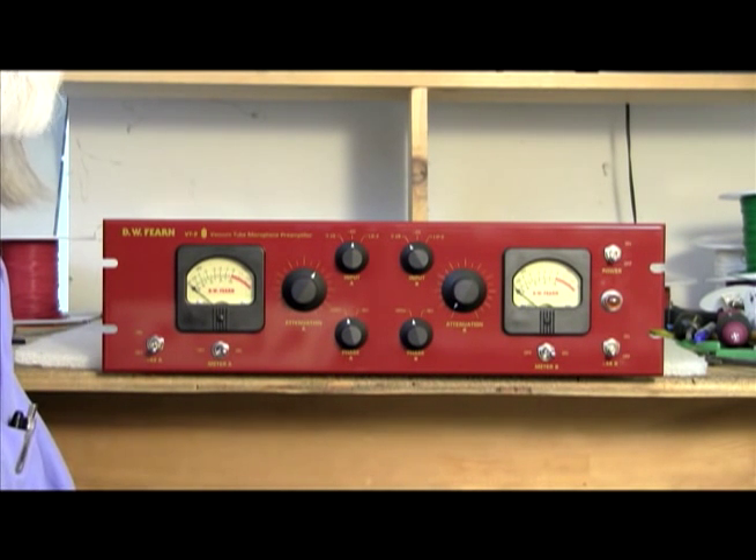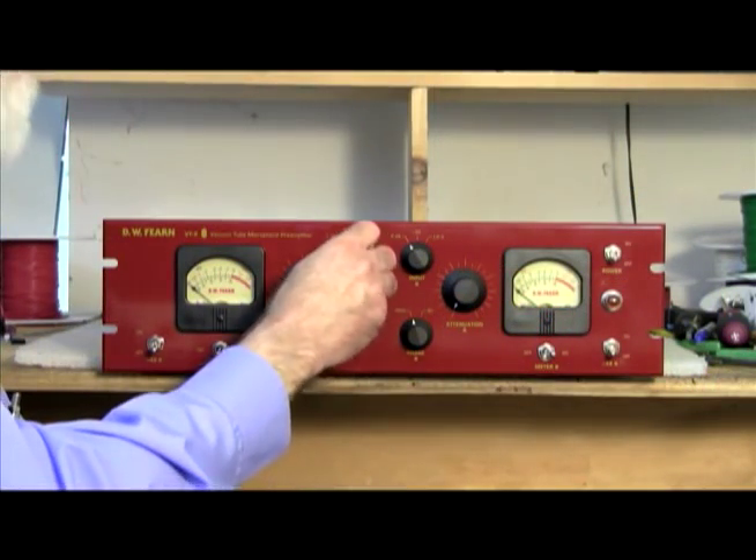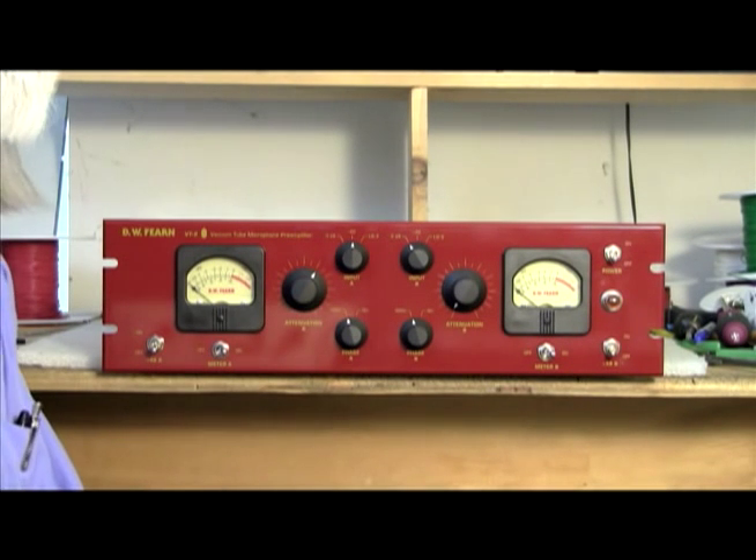But some microphones react differently when going straight into an input transformer versus seeing a resistive load provided by that 20 dB pad. So sometimes the sound changes subtly — more obvious with some microphones than others, but oftentimes you will hear a difference. We can't say whether it's better or worse, it's just different. Our recommendation is when you need to reduce the level, first reduce it at the microphone. Most condenser microphones have a built-in pad which will drop the level by 10 dB or 20 dB. If that still isn't enough, then you can use the minus 20 position on your VT2.